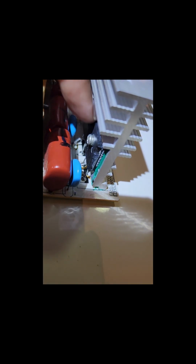I have bad lighting. Okay, so this inverter board comes with a rectifier bridge and 2 full bridges. This angle I think might be better. Yep, 2 IGBT transistors. So these are the IGBT transistors, and these are the high voltage diodes which actually discharge this coil.